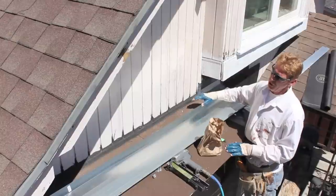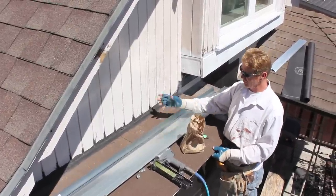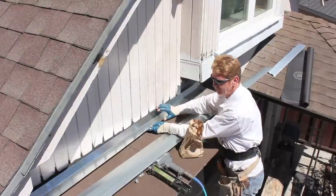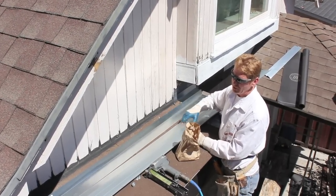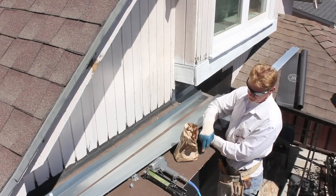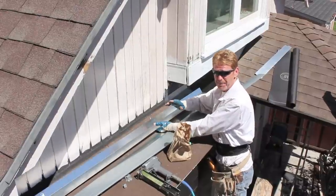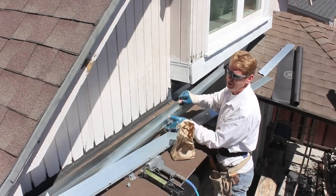Now, the homeowner, he's hired me and he's kind of doing all the GC work, general construction, so he says he'll do all this, but we got the flashing, which is 4 and 4. Put it on here and it kind of was cockeyed like so. So what we did is, I said, let me handle this part. Rather than use a drip screed, which we generally will counter a flashing with here, I figured, because he may need to change this torch down at some time, I went to a couple material yards, and I finally ended up, because Home Depot, my material yards, West Side, they don't sell this zinc flashing.